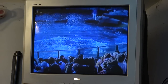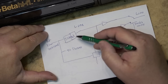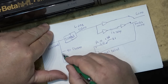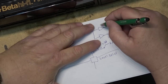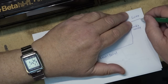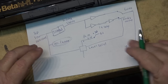I'll try to illustrate how a dropout compensator works on these analog machines, oversimplifying just so you get an idea. You have two video paths: your RF output from the head goes to your demodulator, which gives you your luminance — black and white information, your video, no chroma. The chroma goes to the chroma circuits separately, because the dropout compensation in no way affects the chroma — it's only on the luminance signal. Both signals go through an op amp, amplified exactly the same way. One signal passes through to a switch and continues out as luminance output to your YC circuits.